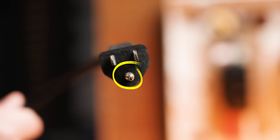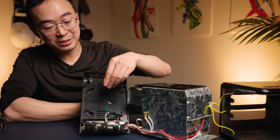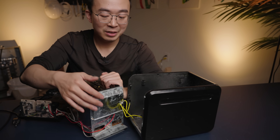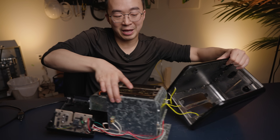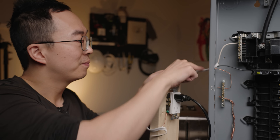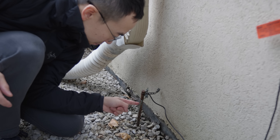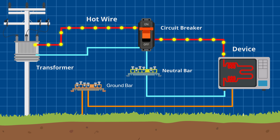Ground — it's the round pin, and it could have stopped me from getting shocked. We follow this wire into the case. Let's fix that connection from ground to the metal section that shocked me. Now everything is joined together to the ground pin, which goes through your outlet, down a copper cable, and eventually attaches to a grounding bar inside your electrical panel. This shoots outside to a grounding rod buried several feet into the earth. This forms our emergency circuit, commonly called ground.